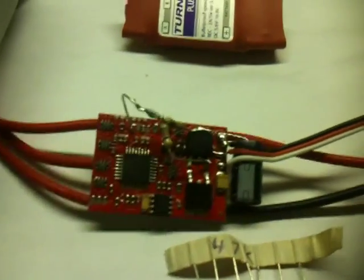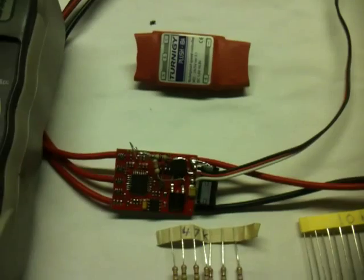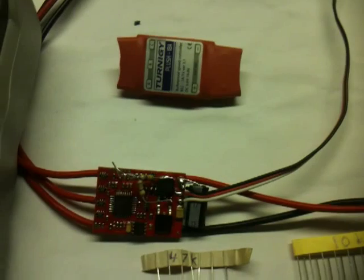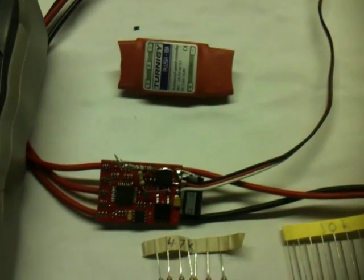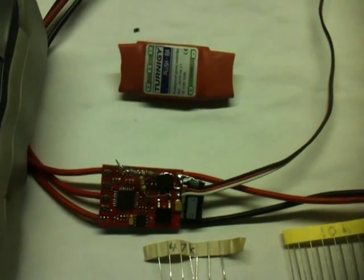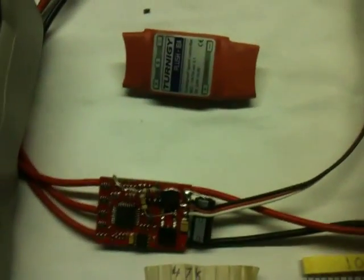The pin connected to it is the second pin from the top. I connected it up at the resistor I removed — it was a small resistor. I haven't run the motor on an empty battery yet to fully confirm it works, but I've tried connecting different batteries and it always beeps as if it's a 3S, so I guess it will work.